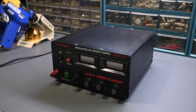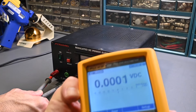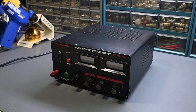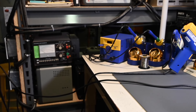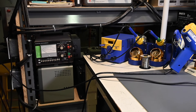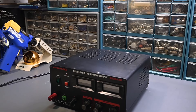If I grab my meter and probe the output jacks, you can see on the display absolutely nothing. The probes are in the power supply jacks on the front — absolutely nothing happening. Just to show it is plugged into a live outlet: the power supply cord goes over to this outlet right here, and if I put my meter in there, that is in fact a live outlet. So definitely a problem in this power supply.